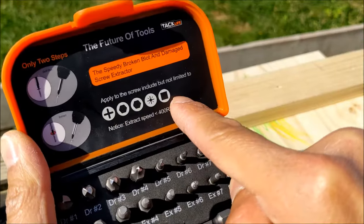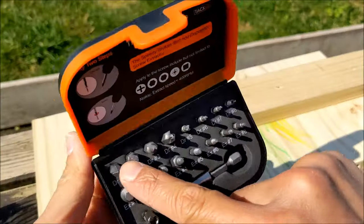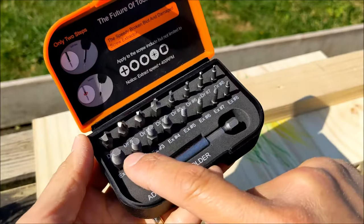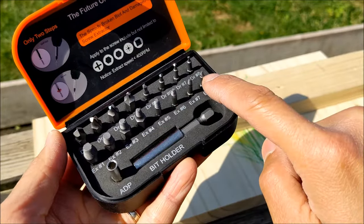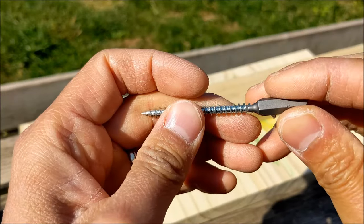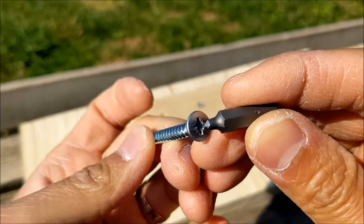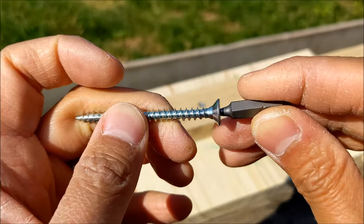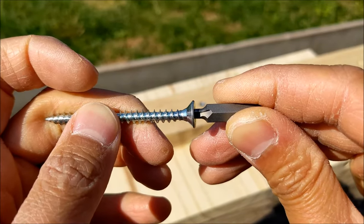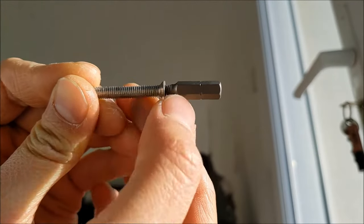The technique is: you use the top row of drill bits first to make a small hole, and then you extract with the extracting drill bits. From my experience there's a bit of a learning curve, and you have to match the drill bits to the central shaft. One easy way is to make sure the drill bit can hit the bottom of the screw head. If all goes well, your drill bit will be stuck to the central shaft.